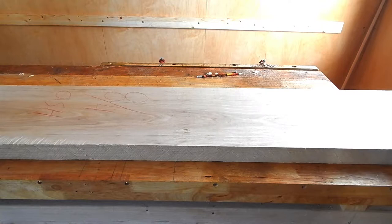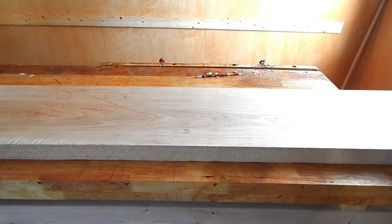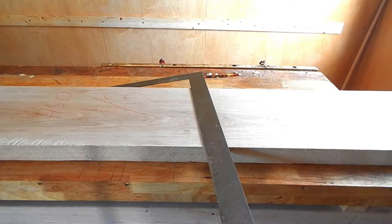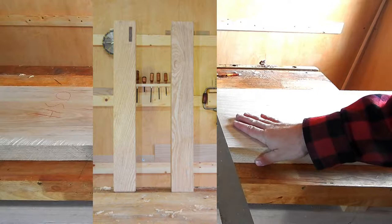The channel is going to be a little bit concentrated on this table build for a while now. Today I'm going to start out by doing a lot of my layout work. The first thing I'm going to complete is the legs. They're pretty simple. I've got this 8-quarter ash. I'm going to cut it into 4-inch strips, glue two of them together to make 4x4 legs.